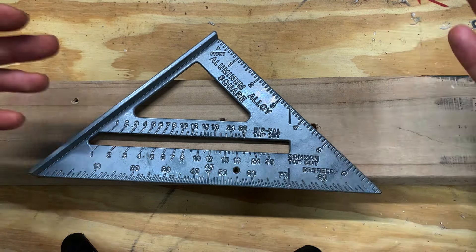If you've never used the speed square before and don't know how to come up with angles - a lot of people use them to get square, but don't know how to actually do the angles. So if we call this spot right here zero degrees, and we rotate it - you can see there are degrees on here. These are the numbers we need to pay attention to along this angle. Starting at zero, if we move this to where the back of the board lines up at 10, this is now a 10 degree angle cut. So if we keep pivoting to where we get to 31 degrees on the backside of the board, this angle is now 31 degrees. This scrap piece would come off and this would be the good cut - that's 31 degrees right there.